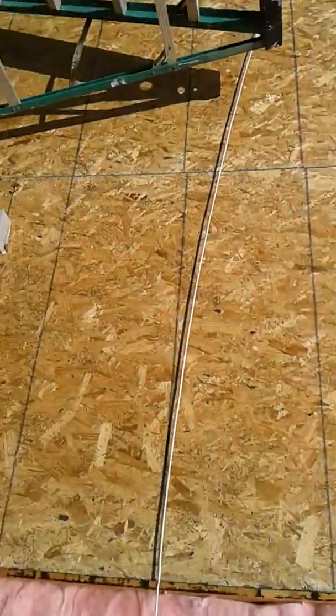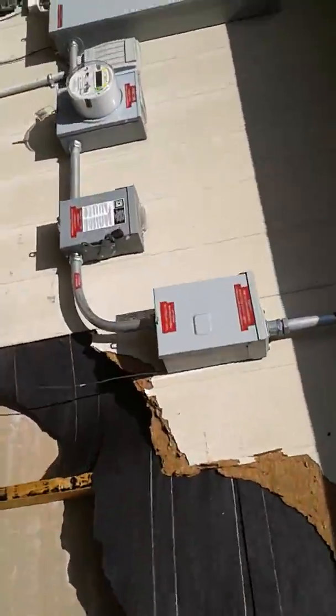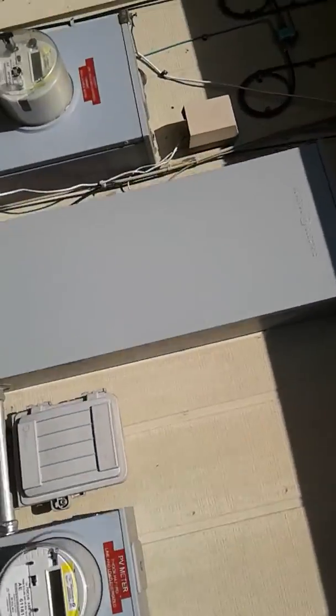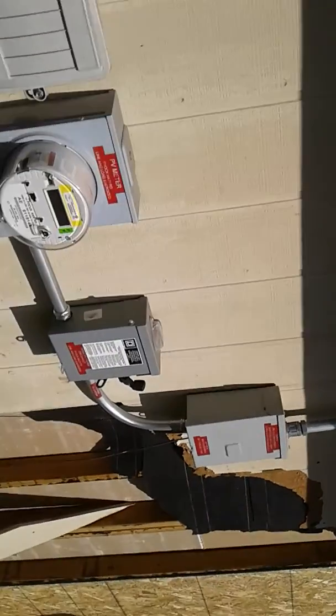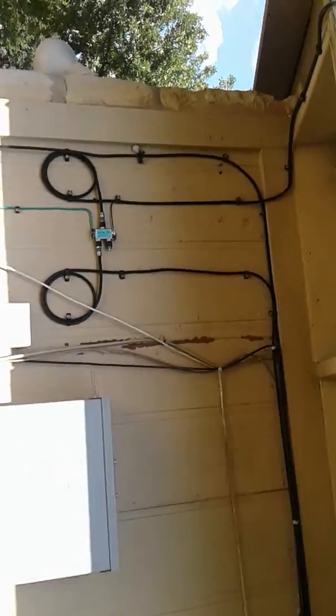The biggest difficulty in doing this is unattaching these electrical panels from the back. The way my old residential master electrician boss told me to do it was to drill a hole in the top, put a bolt in there with a wire going through, and then screw an eye bolt into one of those rafters right there and just have a piece of wire holding it. That's everything downstream from the main breaker, but that's probably how you do it.